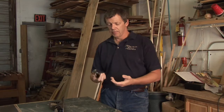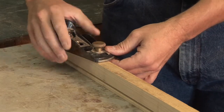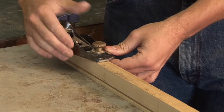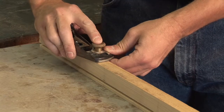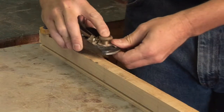You want to hold it properly — the little ones you can hold in one hand, the bigger ones you want to use two hands. With two hands, it's an entire body move. You want to lock your feet down and then move your hips — that's where you're going to get your nice smooth motion. We're going to go ahead and make that first pass. I like to set the plane at a bit of an angle on the stock, and maintaining some firm pressure, we're just going to rock our body forward and make that first pass.